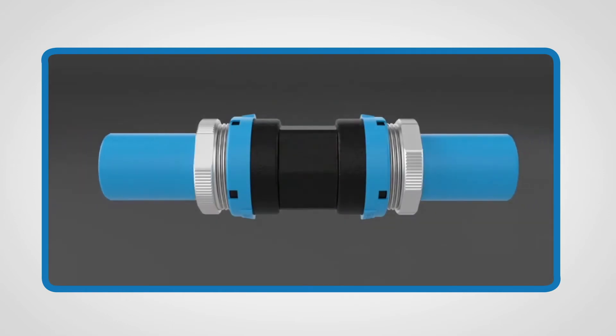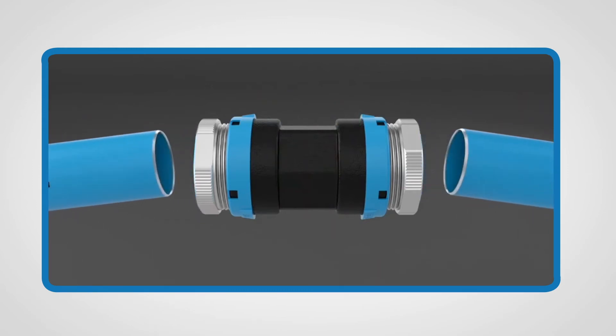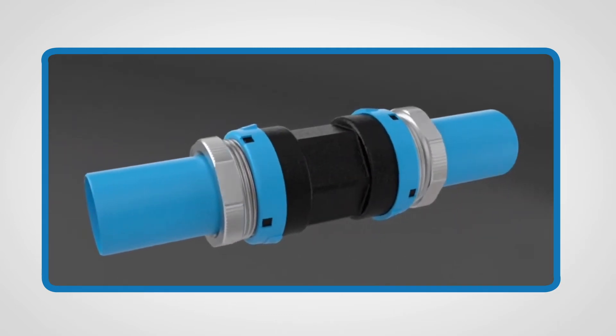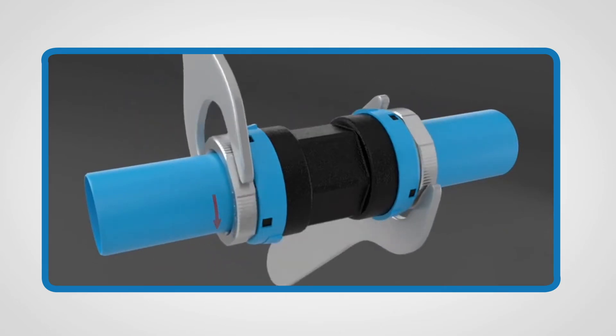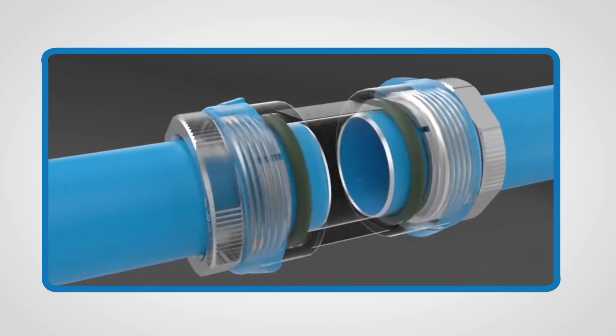The system does not require special tools to assemble or special jigs for drilling outlet ports. You simply insert the pipe into the fitting until it seats firmly and squarely against the high-grade O-ring. You must be sure that the axis of the pipe in the fitting is square so that the clamp ring in the fitting is not compromised. Then tighten the nut to hand tight and use the connection one quarter turn further or until the pipe starts to turn. As the system is put under pressure, the clamp ring tightens further and slightly cuts into the pipe, ensuring that the fitting cannot slip, slide, or come off.